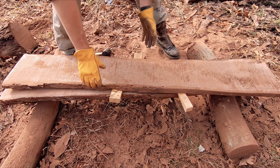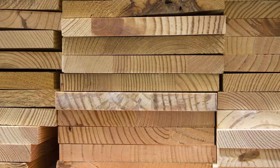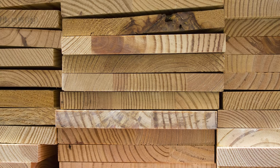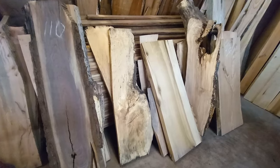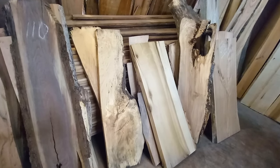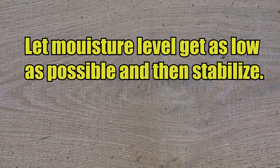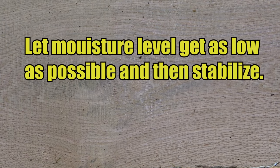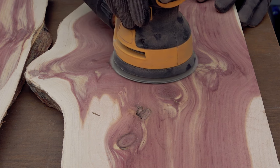The biggest question folks have is how do you know exactly when your wood is dried out and ready to be put to use? One of the most accurate ways to do this, which I highly recommend, is to use a moisture meter. You can get these at wood shops and also on places like Amazon. Keep checking the moisture level of your wood until it stabilizes and holds steady at the lowest number you can get it to for several weeks in a row. There's really no magic number to look for, as it will depend on where you live, how thick the wood is, and what kind of wood it is. The key is for that number to get as low as possible and then to stabilize. Once you get that number down as low as you can get it for an extended period of time, that's probably as low as the moisture level is going to go — thus your wood is ready to be used.